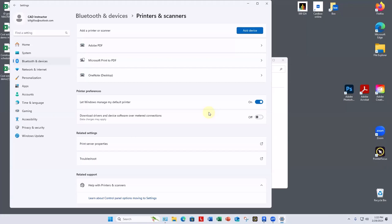One thing to bear in mind: when we're printing to scale, we want to be able to measure the final print with a ruler — a three-foot door or whatever. When creating the print from Revit to PDF, we need to say scale at 100%. PDF likes to shrink stuff to make it fit, but we don't want that. And when printing from PDF to the printer, we also want to say print at 100%, scale at 100%, not to fit.